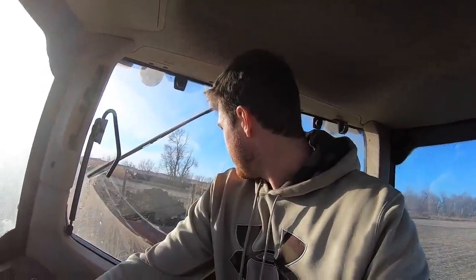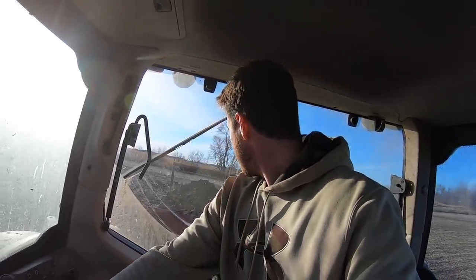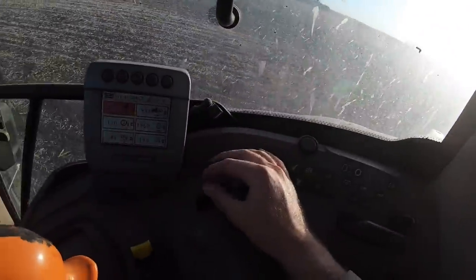Seem to be having an issue. My floor chain won't engage. Okay, here we go. There we go. I can hear it. Sometimes, don't ask me why, it's probably something pretty technical, but usually when I turn it on, I push this number one hydraulic forward. And every time you turn it on, I have to do that. But sometimes it just won't go. I don't know why, like it won't even try. And so you gotta pull it back, which is kind of bad because it deadheads in there because the hydraulic flow is not supposed to run backwards. But you just click it back real quick and then push it back forward and then it gets going. So, crisis averted.